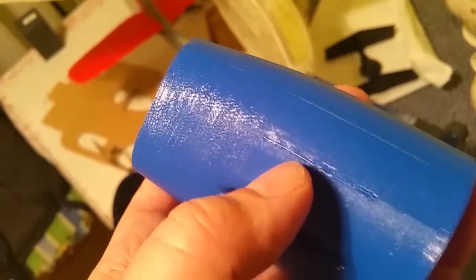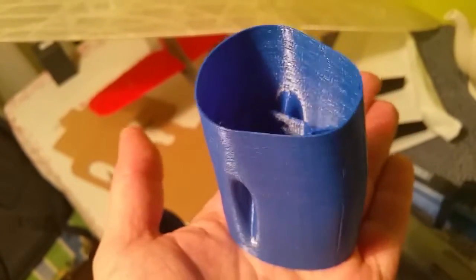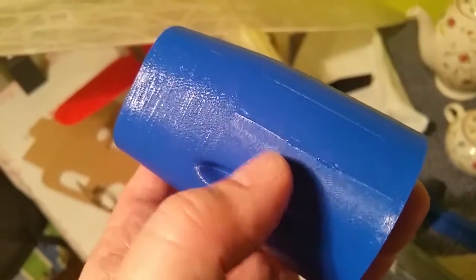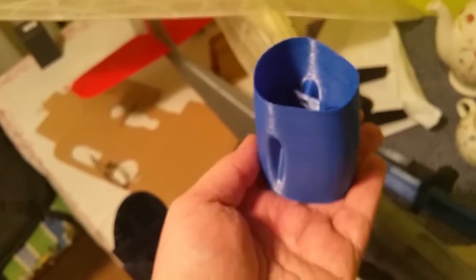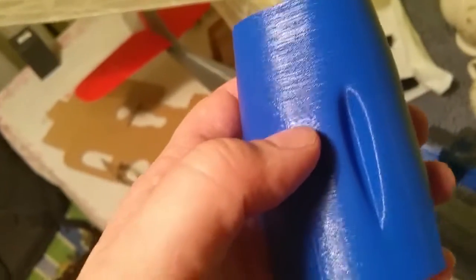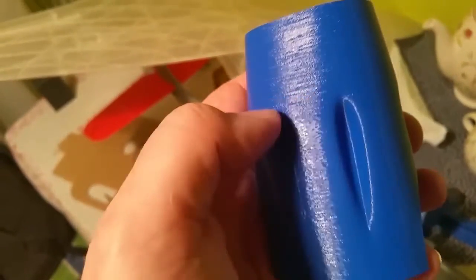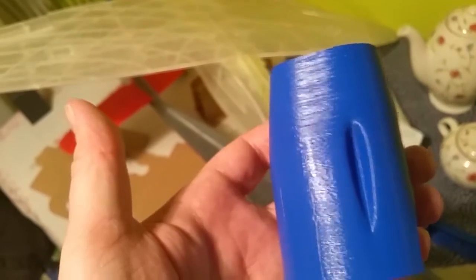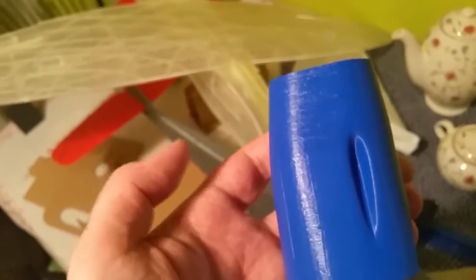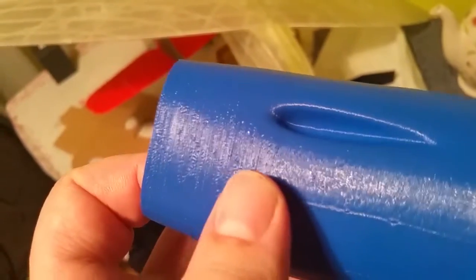If you want enough strength and a nicer surface, you have two options. If you print this part again alone on the print bed, just make it, for example, minus 10 degrees Celsius, or print more parts, and if you print more parts, it will just make the time between layers higher. Yeah? It will print one layer and go on to the other printed part, print the other part and go back and again. It will add some time between layers and it will be okay.